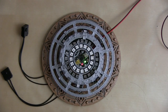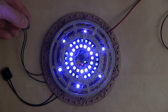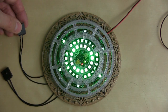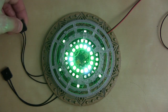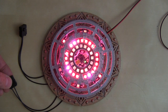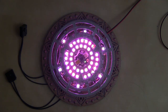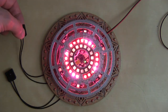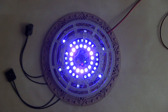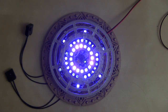So let's power that up and see what it does. Hopefully you can see all the LEDs from there — it takes a couple of seconds for the Arduino to boot. We should see this rather pleasant spinning effect with all of the NeoPixels. We've got two switches — if I press this one, it takes a couple of seconds for the switch press to register. They're latching switches, but we just need to switch them on for a couple of seconds. That changes the colour to green. If I do the same thing again, we should get red. And the other button makes the Unibeam fire — we get a good spinning effect, then full intensity white with a big pulse. And it powers back down to red again. Basically I'm going to be controlling these switches with a microcontroller so I can make the output go low for a few seconds to activate the different functions, controlled from the central control system of the suit.